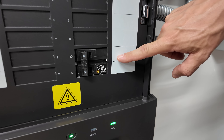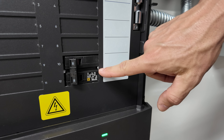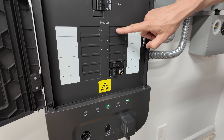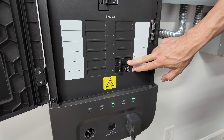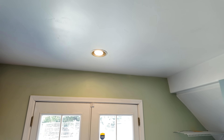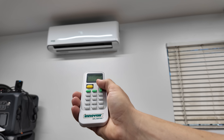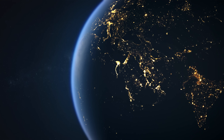As for the electrical integration, there's one circuit setup that connects directly to the main subpanel — that's where power from the generator comes in when the grid is down. There are other open circuit slots which give you the option to move more circuits over as needed, giving you flexibility depending on what you want to keep powered. You can even manage this remotely using the Jackery app. When you pair two units together, you're looking at 14,400 watts, which is critical in both summer and winter, especially if you're dealing with long-term power outages.